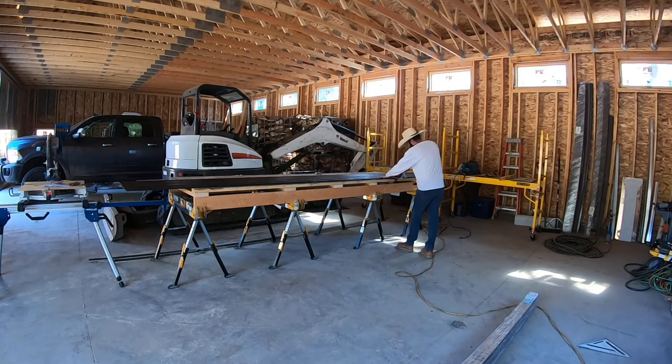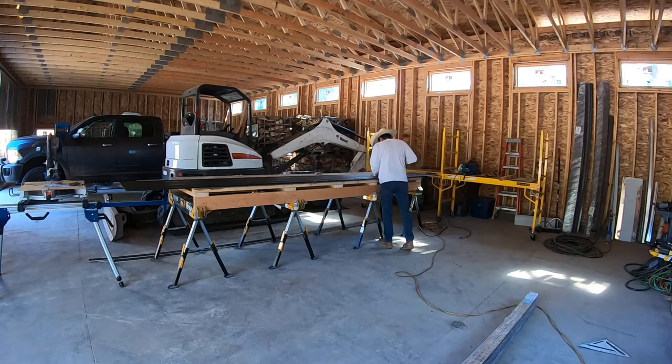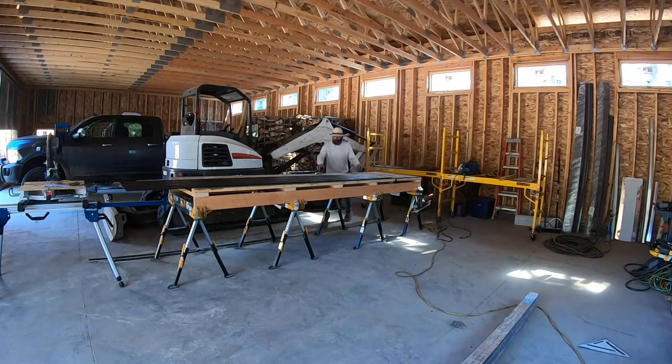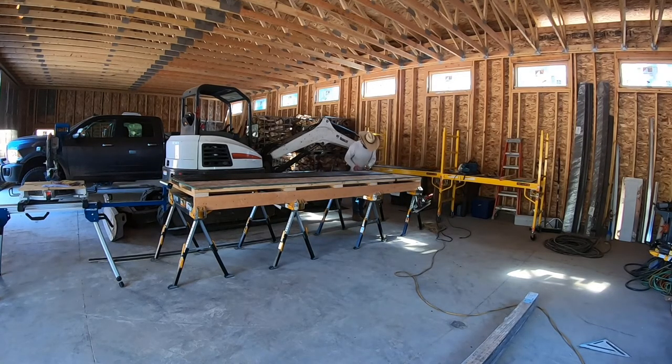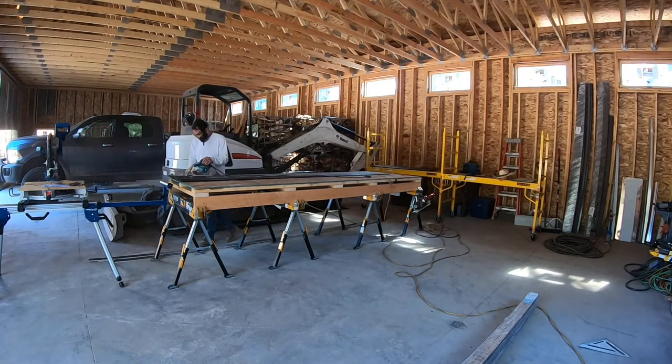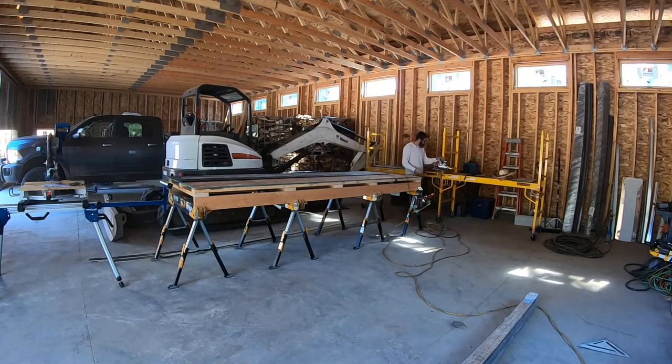Right here I'm cutting the soffit and making a custom piece. I cross-cut this piece using my regular worm drive saw. I have a little Makita finish saw with a guide on it, and you really need to wear goggles because this stuff shoots up a lot of debris. With the guide, it cuts a perfect straight piece. Once you're done cutting, you need to paint all the edges with their special paint — that takes a little time. You've got to cut and paint them and let them dry before you put them up.